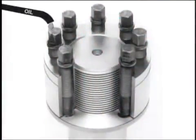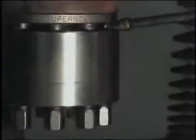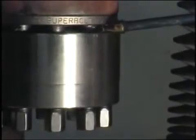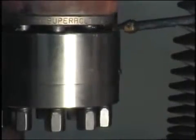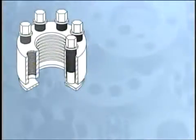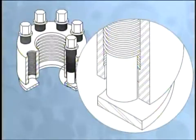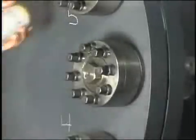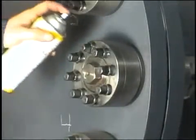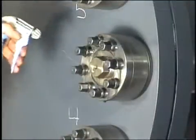Allow time for the oil to penetrate, several hours if time permits. If the oil dries up, reapply as necessary. If the tensioners are inverted, apply oil in the gap between the nut body and the washer. The jack bolts have a small clearance with their mating female hole in the unthreaded region, facilitating the oil to reach the threads. If the tensioners are allowed to cool to ambient temperature prior to removal, first use a penetrating oil, followed by the hydraulic oil.